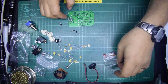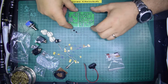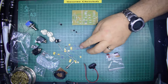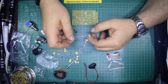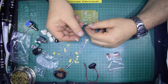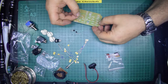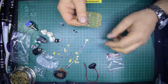So it's just a case of starting with the small components, as usual with all the lunchtime electronics bits, and that usually means the resistors as they sit furthest down on the board. So do I do it the easy way? Yeah, I suppose I'll go by their thing. So what's that say? 15k? I think that's what it says. Does it have space for two 15ks? One there and one there. So yes, let's do it that way.